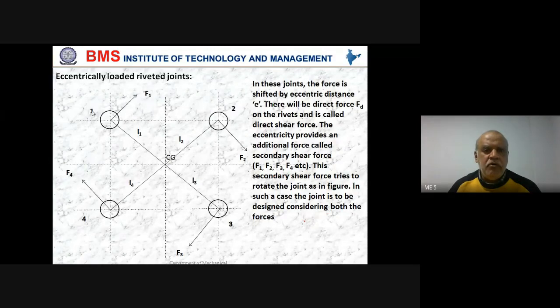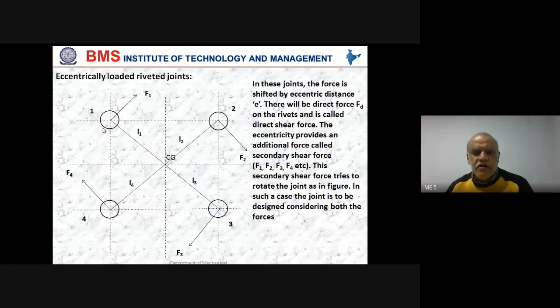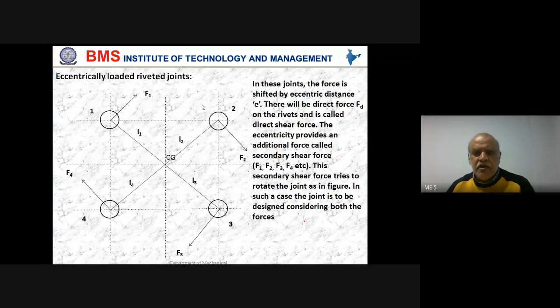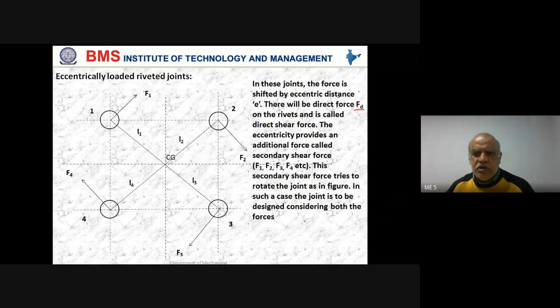Okay, now so we have got four rivets like this. I take out these four rivets and number them as rivet 1, rivet 2, rivet 3, and rivet 4. Okay, and here E is the eccentric distance. That is, the force is shifted by an eccentric distance E. Okay, and what we'll have here is a direct force on the rivets denoted by FD, direct shear force on each of the rivets, and the eccentricity provides secondary shear force